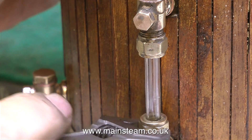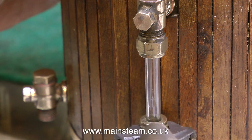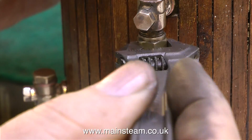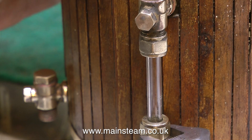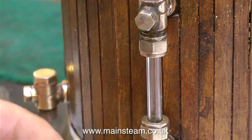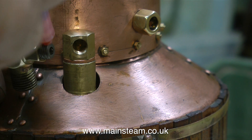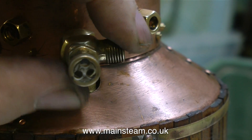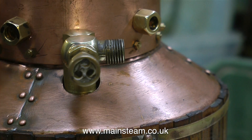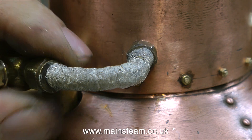Here is another caution: I'm using a spanner to fit the nuts and this is not a good idea — you should really put them in finger tight. If you over-tighten the nut you will shatter the glass. The gauge glass nuts really need to be just past finger tight. The top cap is different — this needs to be put in properly. And once that's in, I can now move to fitting the steam tap. This is the steam tap that I modified and it fits at a nice right angle. It's not mega tight, but by the time the Loctite 542 goes off, it's not going to leak.